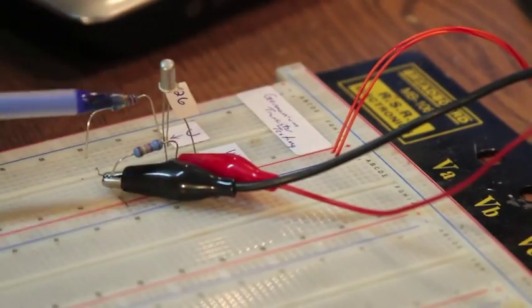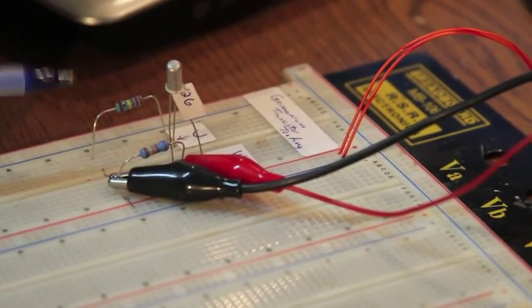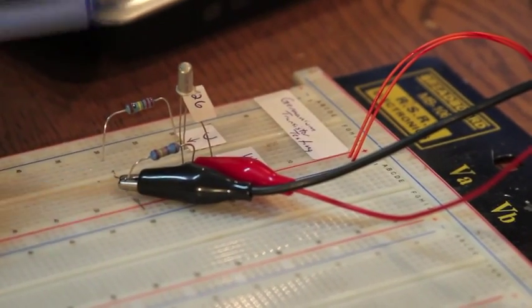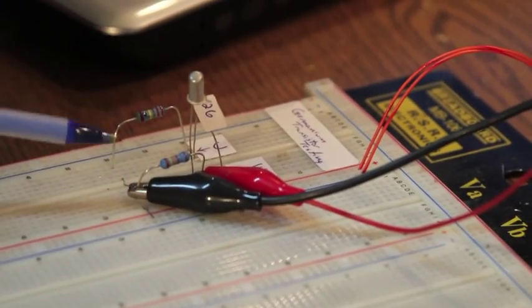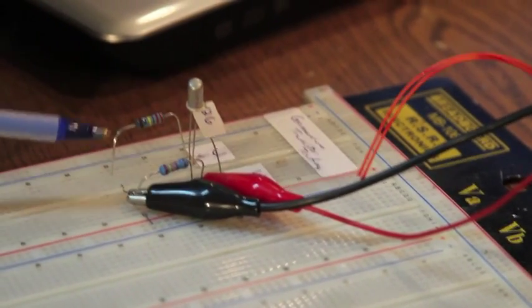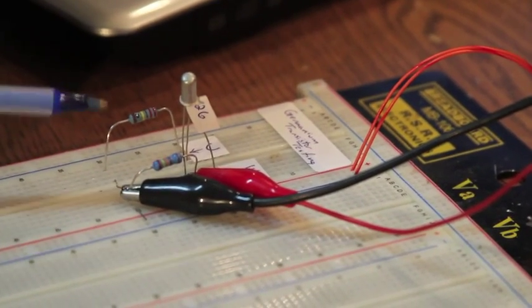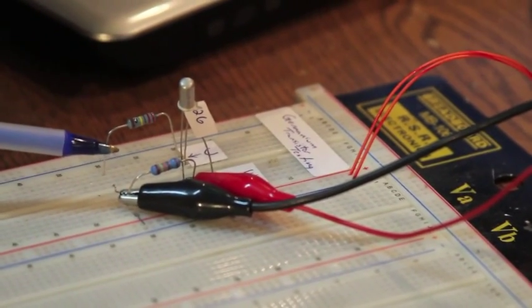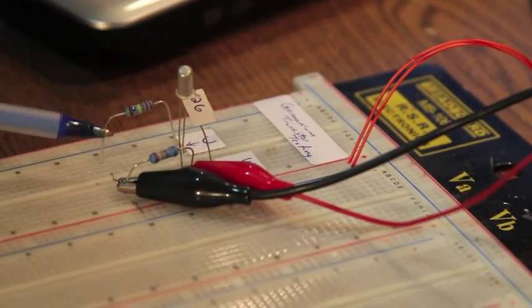And what we're doing is we're testing both leakage current and then the actual current when you're trying to do basically a maximum draw off the transistor. Those two different currents you're then comparing to find the gain, and you're looking for essentially a low leakage current and a reasonable gain, reasonable being about 70 to 90.